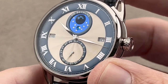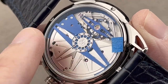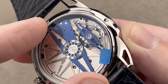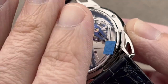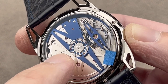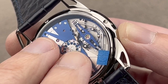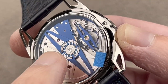On the reverse side, you can see it's clearly related to the movement in the DB25, but the biggest change is the automatic winding system. Five days of power reserve. In order to maximize winding efficiency, Denis uses a platinum mass at the end of a really long lever arm. The problem is you've got rotational motion — which is great for winding — but also translational motion where the rotor can actually tilt from side to side if shocked. To prevent that from happening and damaging the bearing, back in 2006 Denis patented a quadruple spring system using synthetic ruby-set cantilever springs to keep the rotor center planted and stationary so it can rotate but can't torque and twist, protecting the bearing system.